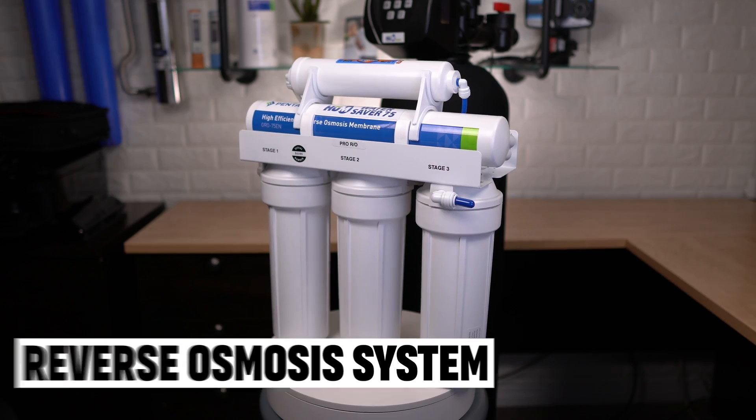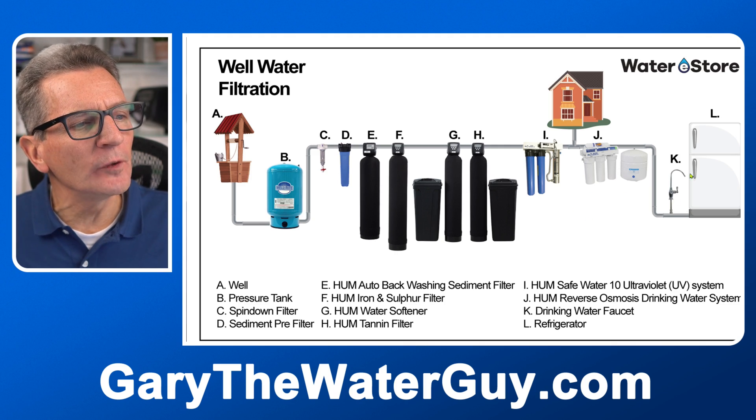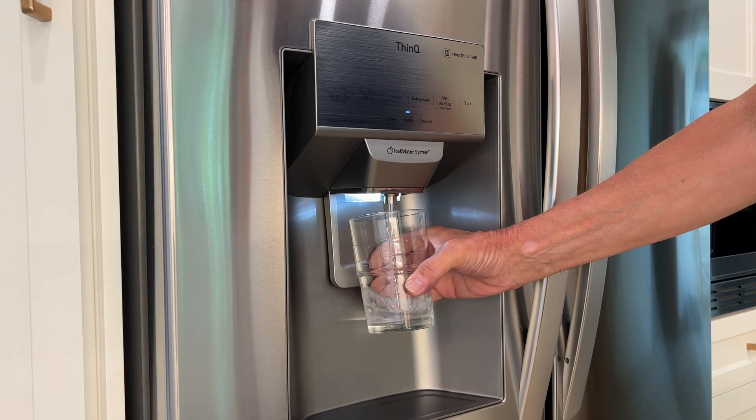To remove contaminants and excessive total dissolved solids like salt, potassium, copper, aluminum, nitrates, uranium, lead, fluoride, arsenic, microplastics, and forever chemicals like PFAS, PFOA, pharmaceuticals, and personal care products — and to create a second barrier from bacteria — you would add a reverse osmosis drinking water system. This goes at the end because it's not a whole-house system; it feeds one faucet at the kitchen sink, and if you have a water dispenser and ice maker in your fridge, it can also feed that.